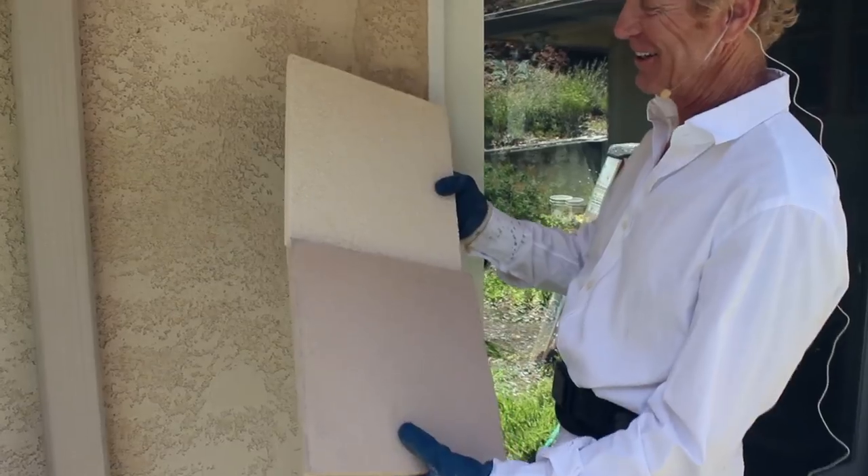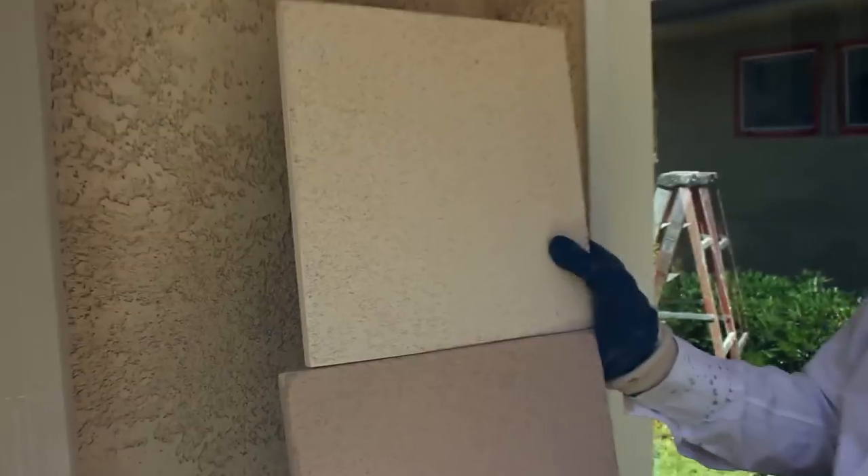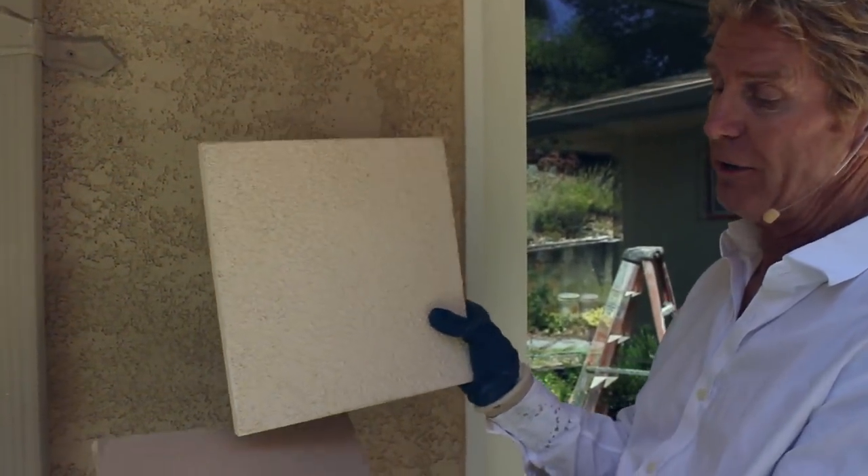Here's another tip. If Jay can zoom in to the top one — notice the grit or sand is a bit heavier. That's called 16-20 right here, the heaviest sand they make for finishing plaster. This is 20-30, that's the technical word for medium sand finish. Then they have Santa Barbara or VMI's marble coat, which is for talcum powder finishes like smooth mission finish or hard steel trowel.